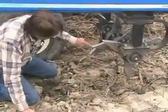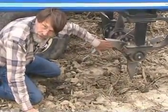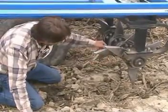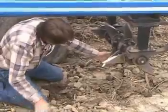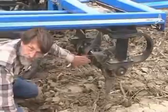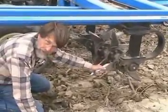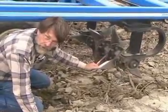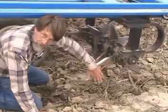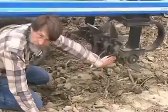The same beveled edge that so effectively parted the soil to the compression thrust side of the tine to accentuate the fracture force also, when it comes out of the soil, allows the side of the hole to actually sharpen the tine. It won't matter how long this tine runs — it will actually get progressively sharper because the soil is coming off the side of the tine. That's a function of two things: the angle and the twist of the tine.